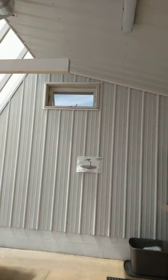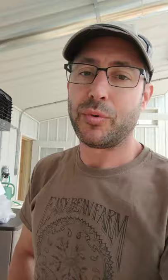There are ventilation windows on both ends. These are currently just manually operated, crank-out casement type — regular vinyl frame double pane windows. The reason those were chosen was for tight air sealing; we're trying to basically control any drafts happening in here. We're having a little bit of an issue with freezing during really cold times when there's excess moisture in the air, but still working on how to address that issue.